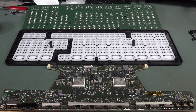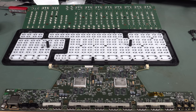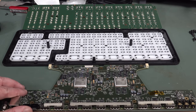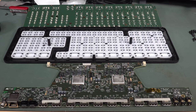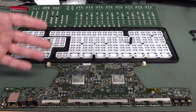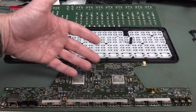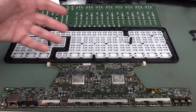I hope you enjoyed that look inside the Blackmagic ATEM Mini Extreme ISO. They do actually have different models going right down to relatively cheap if your needs are quite simple, but this is the top-of-the-range bad boy. It wouldn't surprise me if there's 500 US dollars worth of BOM costs inside this thing, not to mention all the NRE of the design. The hardware is basically two big FPGAs with some memory and some HDMI switching and some USB and Ethernet transceivers.